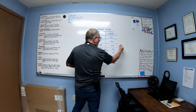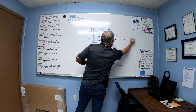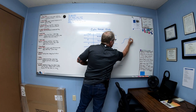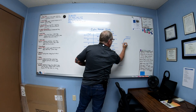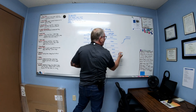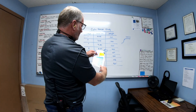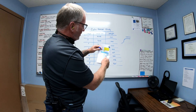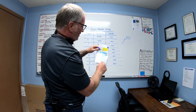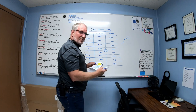What you're actually trying to do is plot it out. Up here at ten seconds the weight stayed the same, then all of a sudden the curve went down. So this would be ten seconds, nine and a half, nine, eight and a half — and you can see the trend starting to fade off and go down. This is where your part starts losing weight. You can plot it with sample one through fifteen on one axis and hold time on the other, doing one-second or half-second increments.